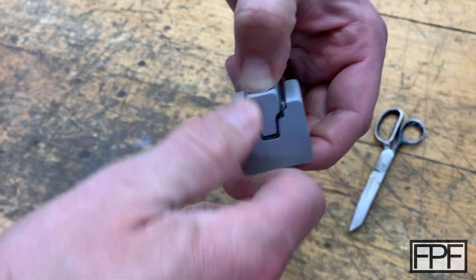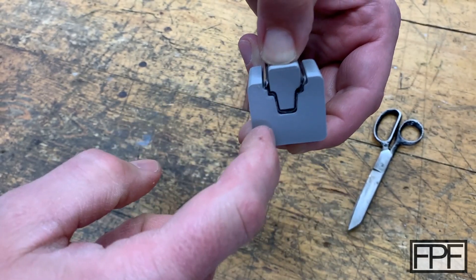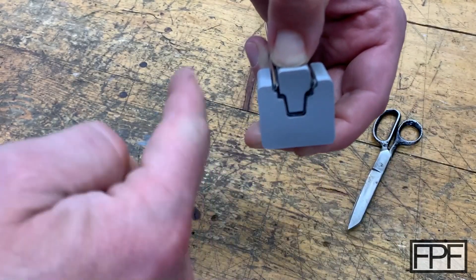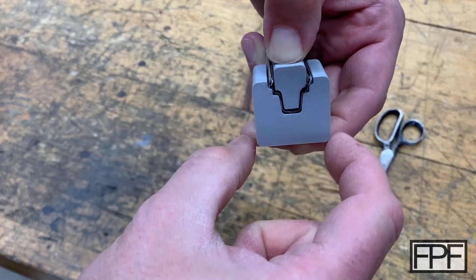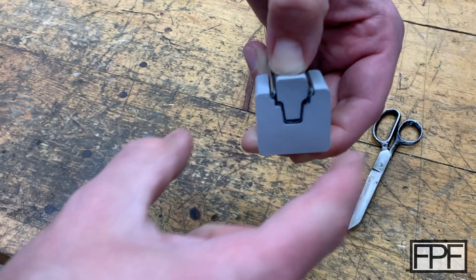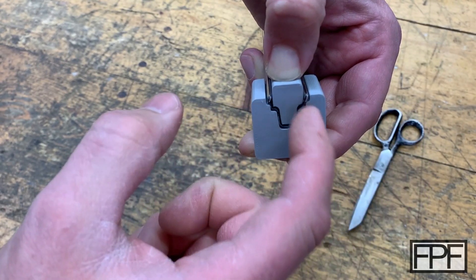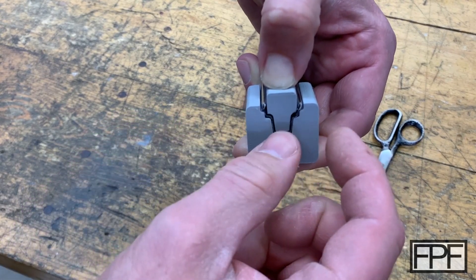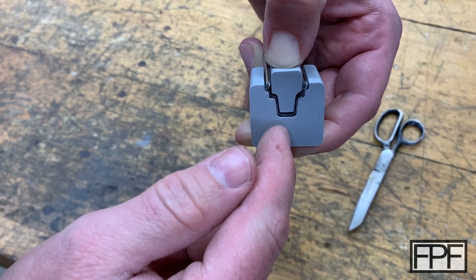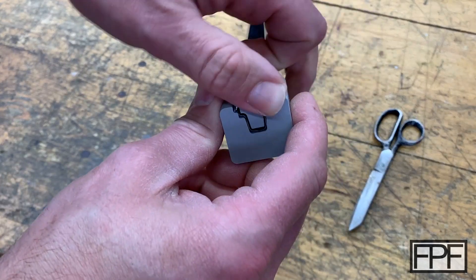I think we've got a chance at this working. If the die holds up — and if it doesn't, if it splits on us here — I think the way to make this even stronger would be to have something on the outside, either make it bigger or something in a stronger material, like sizing this to fit inside a piece of steel so it couldn't spread. Because the PLA is going to be very strong in just a compression perspective, but we're putting this part in tension down here as we push this inner die down in.